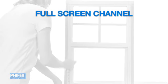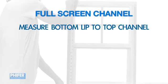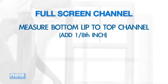But if you're measuring other kinds of windows or measuring for solar screens, remember these important tips. For solar screens with windows that have a full screen channel, place the end of your measuring tape behind the lip at the bottom and measure up to the screen channel at the very top of the window. Add 1/8 of an inch.